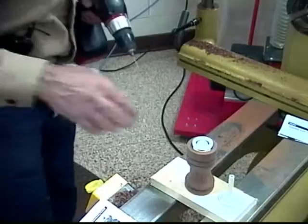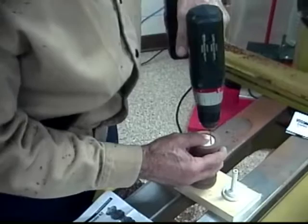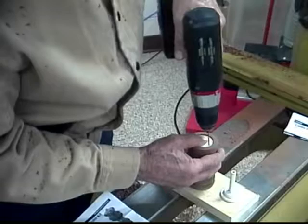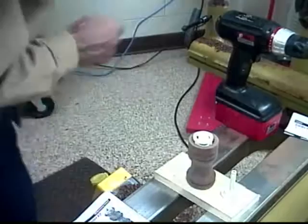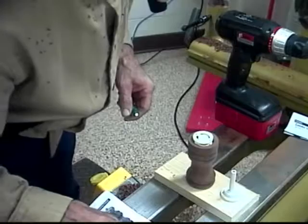It looks like ceramic. Yeah, I think it is. A lot of the other grinders, the pepper are steel and then the salt are ceramic, but this is pepper. And you drill the hole, because it's such a small clearance, drill it on an angle toward the outside. If you go straight in, chances are it'll skin down on the inside of your mill. So just angle it a little bit toward the outside. And that's a 1/16 bit on that. And again, these are the longer of the five.